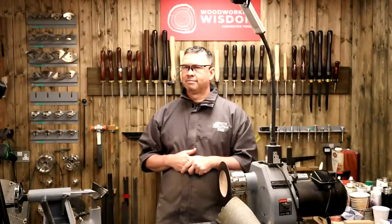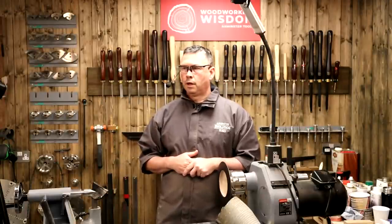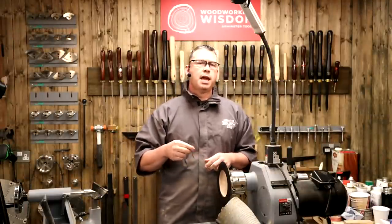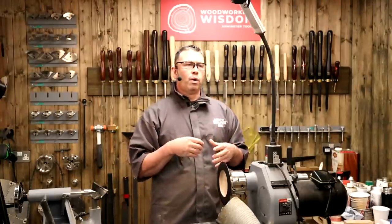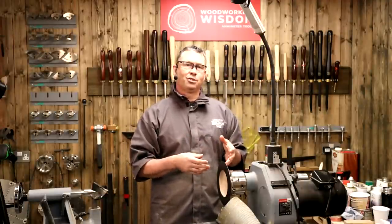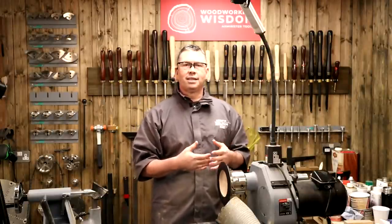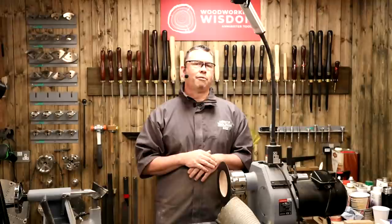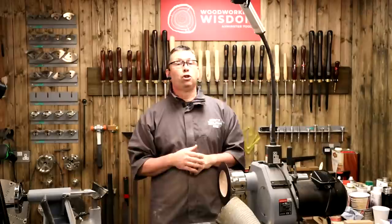I like a very light coloured wood, but I find that a lot of finishes darken considerably. Is there a finish, either a wax or oil or a lacquer, that doesn't darken? Right. Okay. If you think about, even if you put water on a timber, you're going to darken it. When that water dries, it goes light again. The trouble is, when you put a finish on, it sets. It doesn't evaporate. That's why you're getting that darkening to the timber. So there's your experiment. If you put a little dab of water on, that's going to be the color that's left by any finish, unless you probably minimize that by using something like a neutral wax.